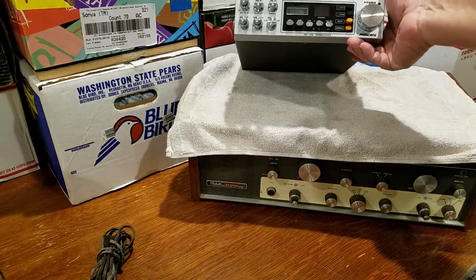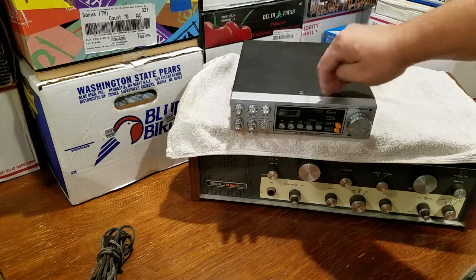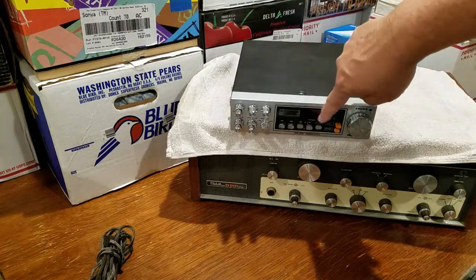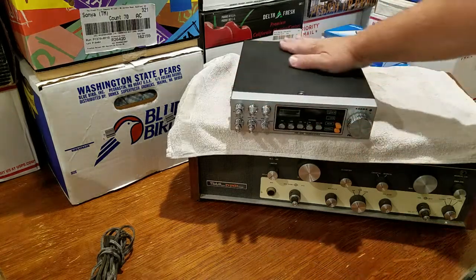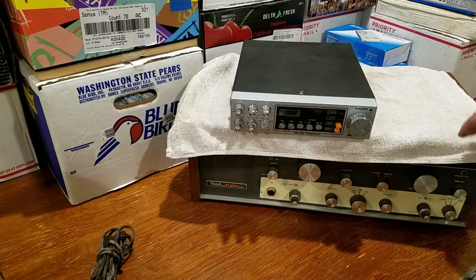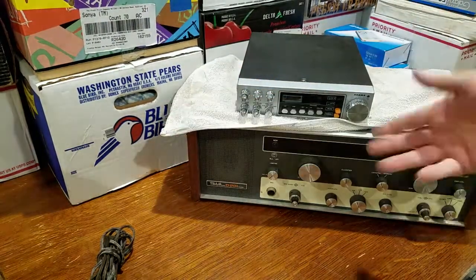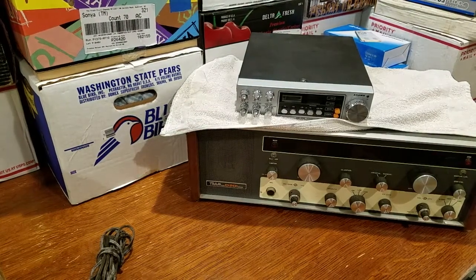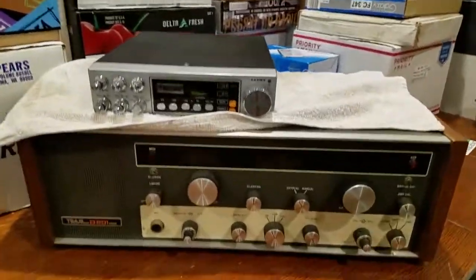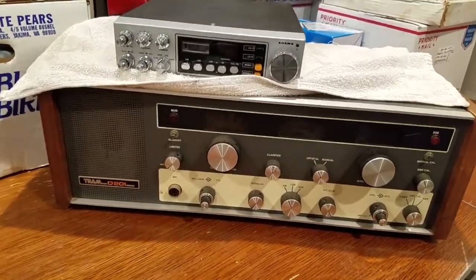So I recapped this a few years ago and rebuilt the meter because the meter stuck, and fixed the LED display because it was missing a few segments. And gosh darn it, she's a runner. So there you go, guys. Thanks for watching. And we'll do more. But yeah, the Tram Diamond D201, the 23 channel version, and then the President Adams. I'm sorry. Yeah, the D201 and the President Adams.